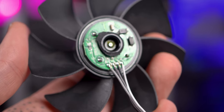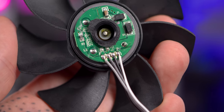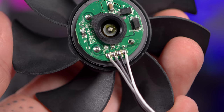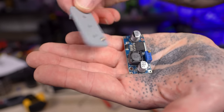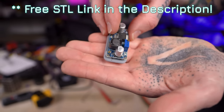Sure enough, it is labeled. Black is 24-volt positive and dark gray is ground. We have white and light gray, which are P and F — TAC signal and PWM respectively — I just don't know which is which. To step down 24 volts to 12 volts, we're going to use a buck converter and one of my buck converter mounts that can either be screwed on or double-sided taped in place.